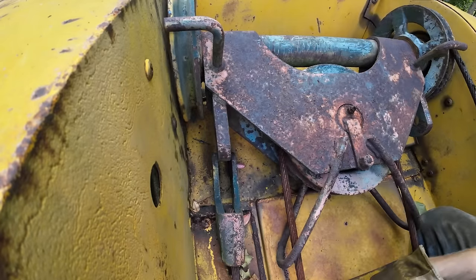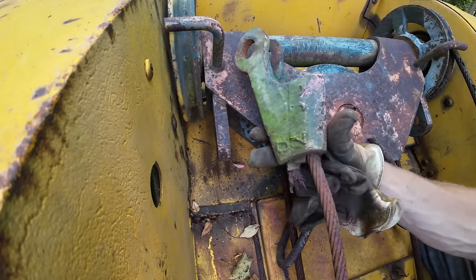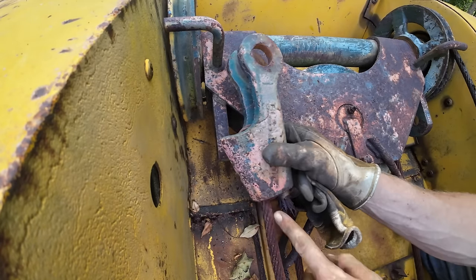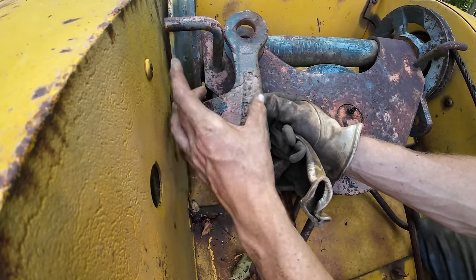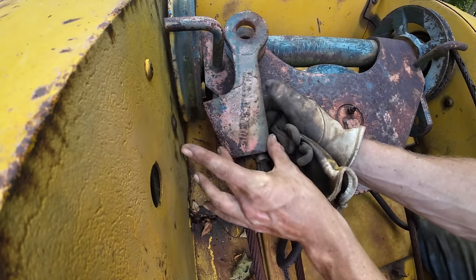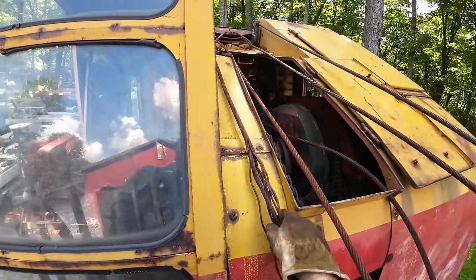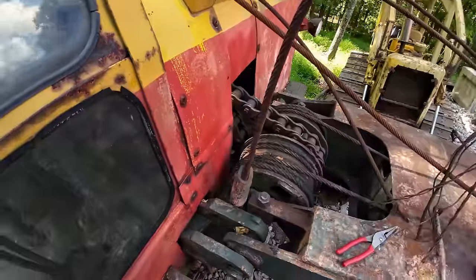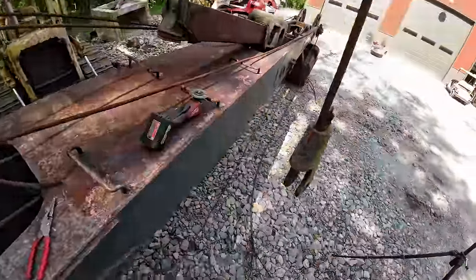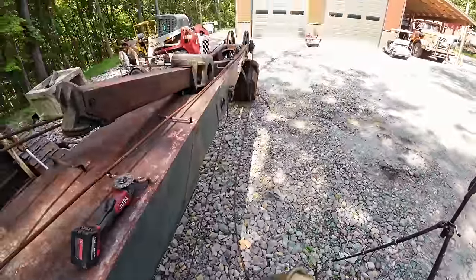All right. That wasn't too bad, all things considered. There's the becket. As you can see, the cable just comes up through, folds over itself, comes back down, and it traps that wedge in there, and it pulls it down into this triangle shape, so it wedges itself in there and can't pull through. Now you can see why I cut the cable too, because we're only fighting 6 foot of rope rather than the weight of the entire assembly here.